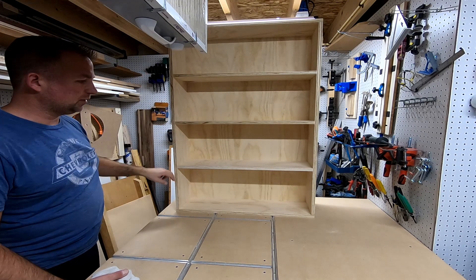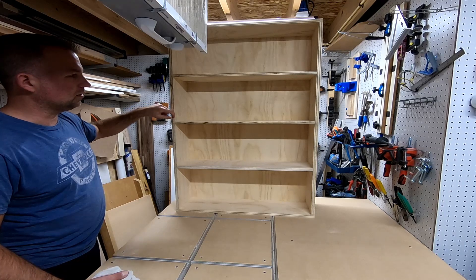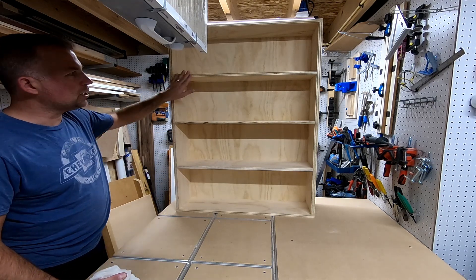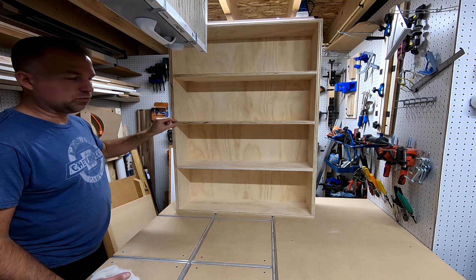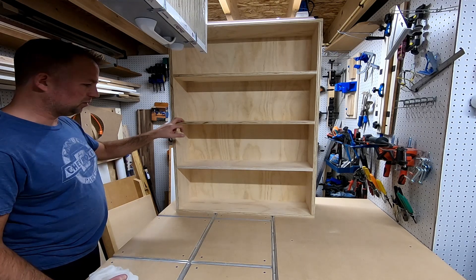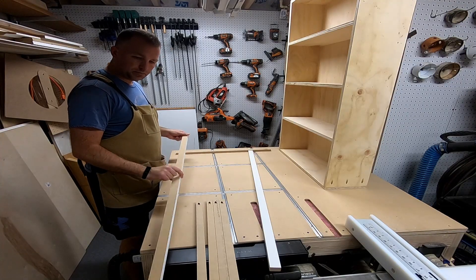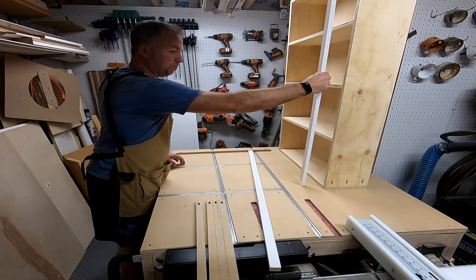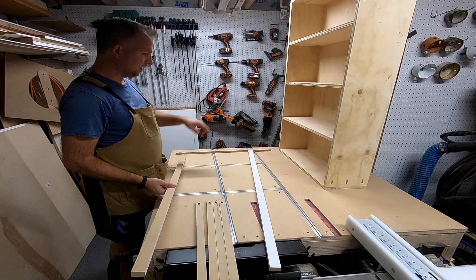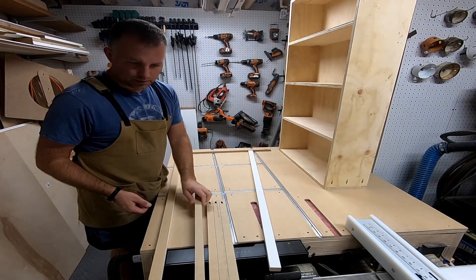Now I've got to build casing for the whole edge to go around. I'm going to do about an inch thick and it'll go all the way around all these edges to cover them up. You could do edge banding, but I like to use real wood or MDF — I think it comes out nicer. I had some MDF left over from the wainscoting project so I ended up using that. It'll make a beautiful edge and it's already somewhat primed white. I did inch and a quarter on the sides and one inch on all the center ones, so they'll fit right in and cover over the shelves nicely.